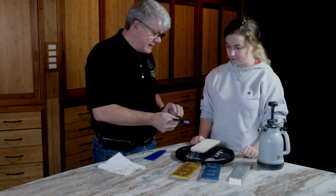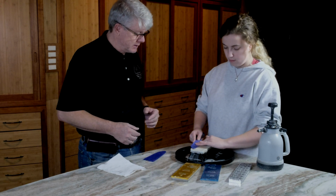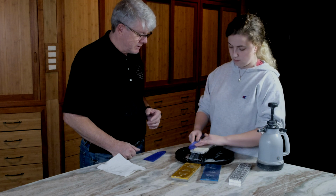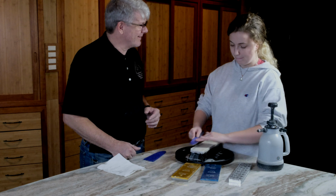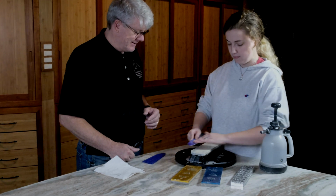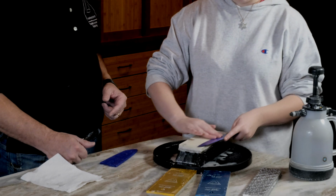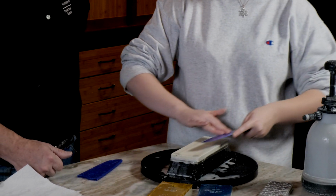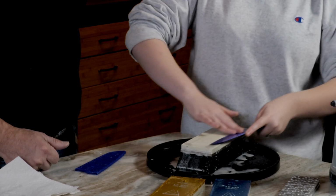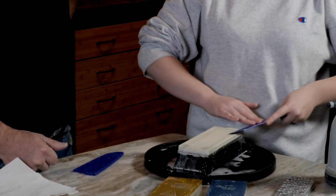So what I want you to do is about 10 stropping strokes on each side of the primary edge. 1, 2, yep. You could hear that, right? Okay, and the other side, same thing. You have to lift your elbow up a little higher to get to the point. There you go. That's it. Beautiful. Yep, that's really good.